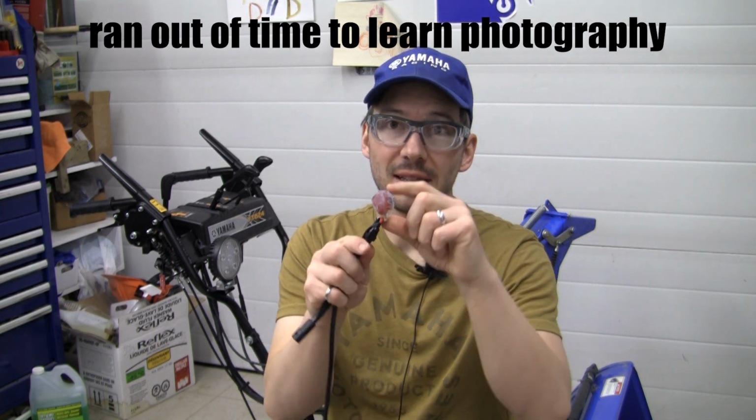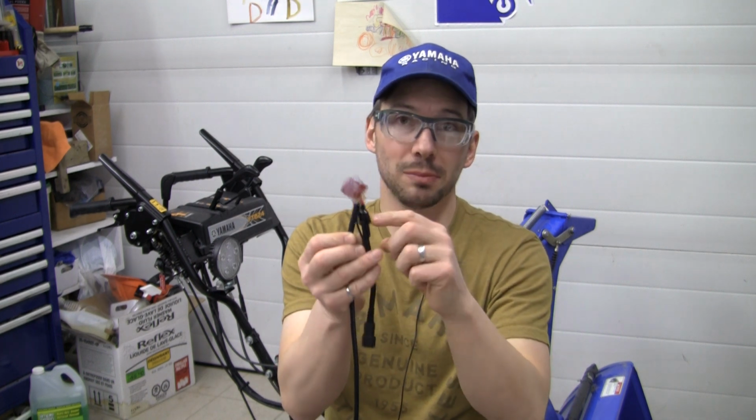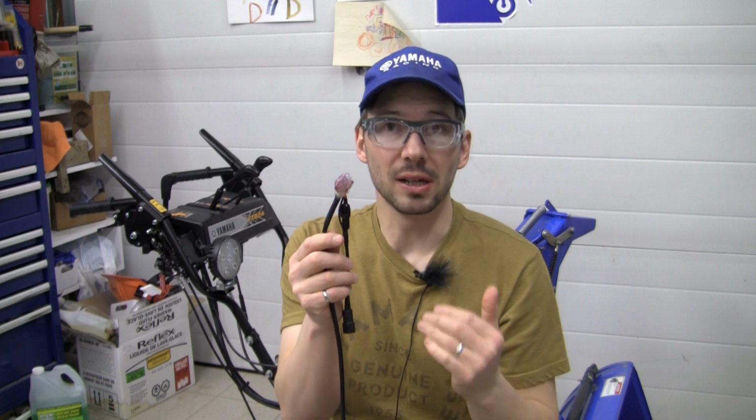And then I'm going to do a little bit of a play-by-play on the circuit schematic. But what this device essentially does is, if the battery is disconnected and there are really large overvoltages, it'll detect that the voltage has gone above approximately 14.5 to 15 volts. When it detects that, it's going to short the 12 volt rail to ground through a 3.3 ohm resistor. And what that'll do is it'll blow the fuse. The fuse here is a 1 amp and the light is maybe 0.9 amps.